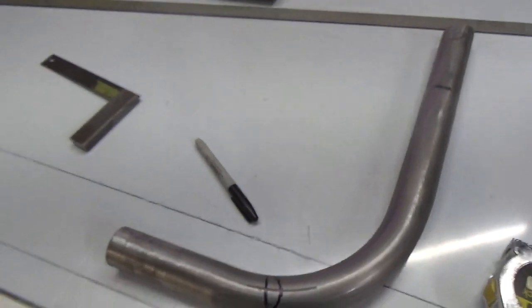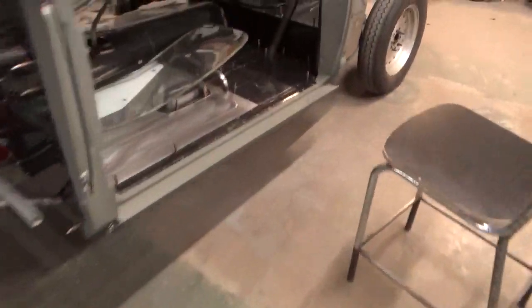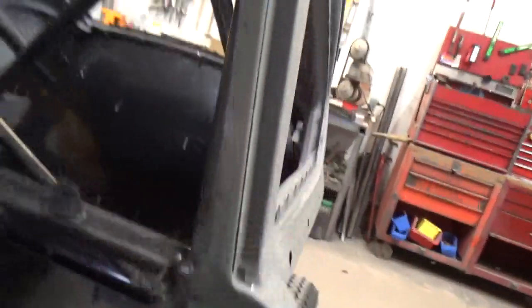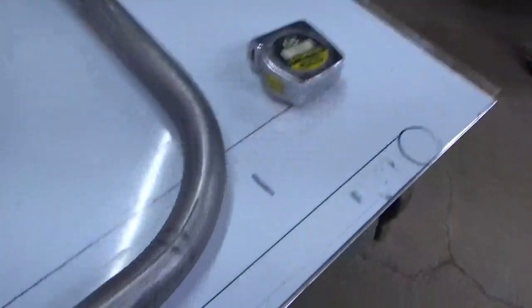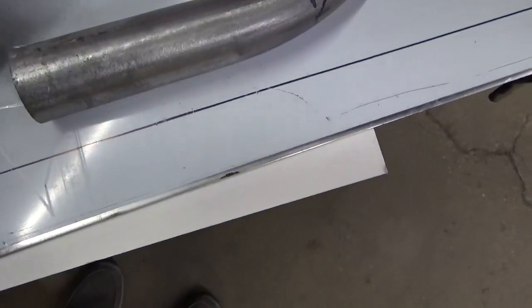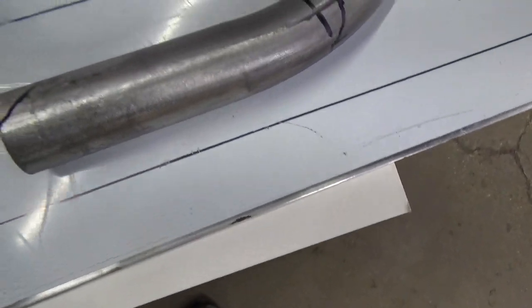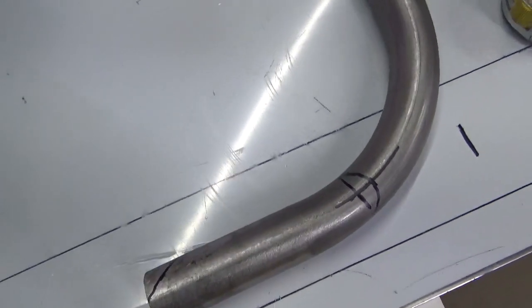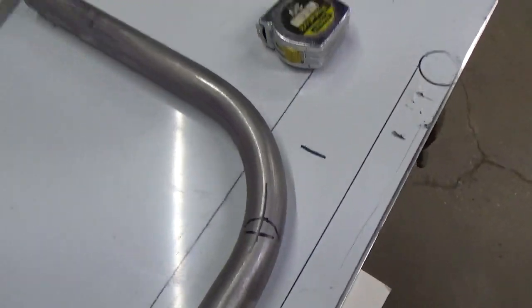One other one I'll share — say you're going to cut a door diagonal. Your door diagonal goes from this point here to this point down here. You know where the long point is there and the long point is up there — you cut the tube that length. Then you can hold this thing up, and you don't miter them. You leave the tube square, hold it in there, mark where you see the intersect, and just go halfway — cut from there to your intersect line like that, then grind it to fit. Pretty simple. That's on tubes that you can't get in your tubing notcher.